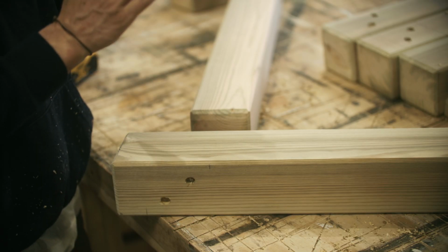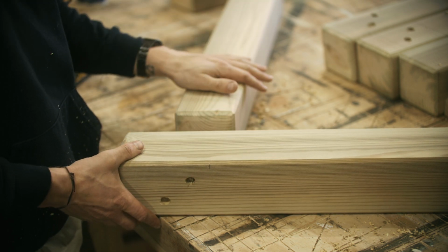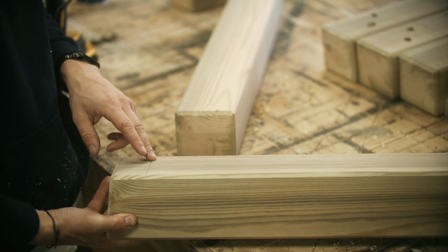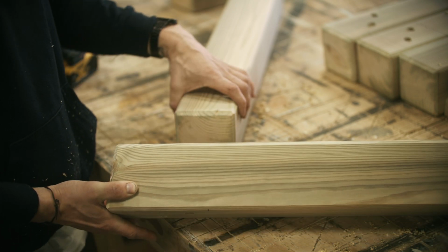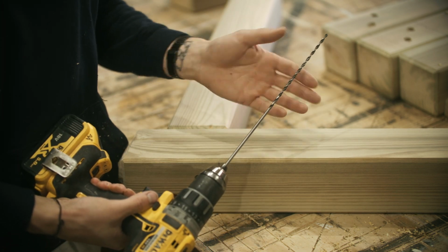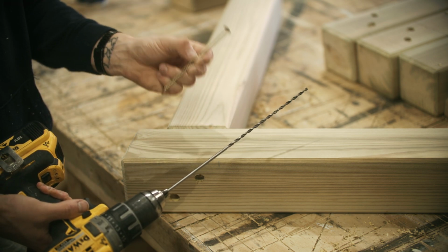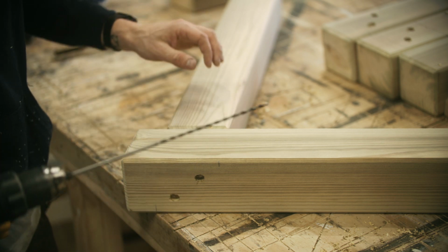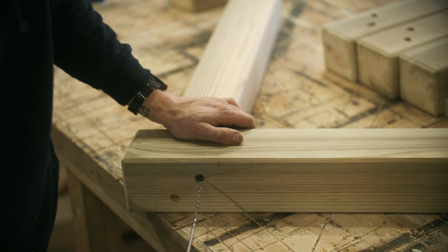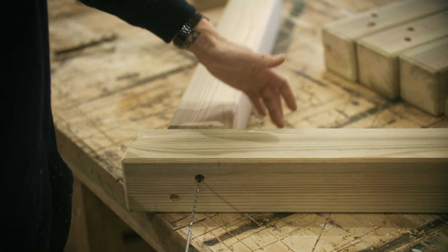Okay, so I drilled holes for all the 4 legs now, and now I'm going to take one of the legs, one stretcher. I'm going to line the stretcher up with this line on the back side of the legs. Then I've switched to a long drill bit. So this one is 4 millimeters thick. The screws are 6 millimeters, so it is a little bit thinner. I think actually it's maybe 4.5. And I'm just going to drill a hole down the center of this bigger hole.